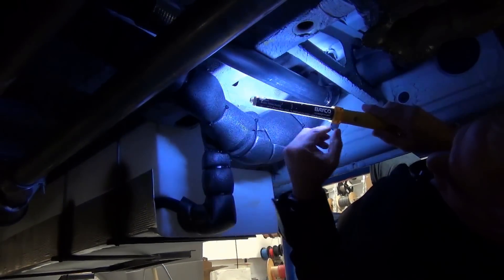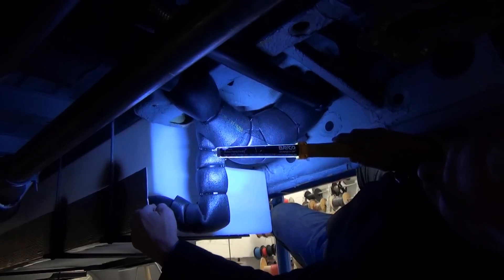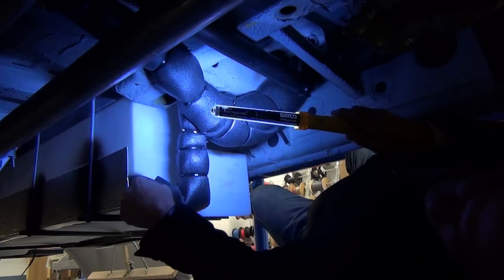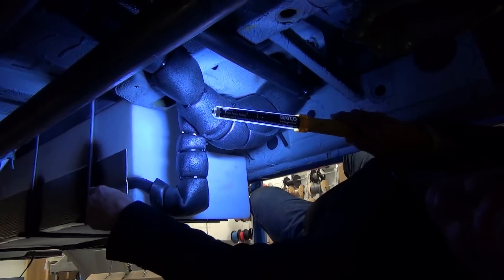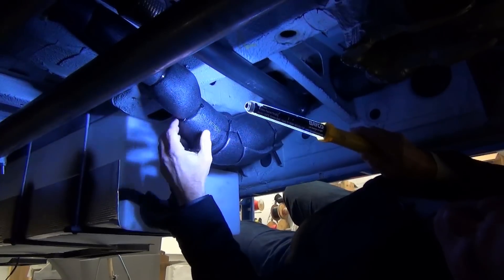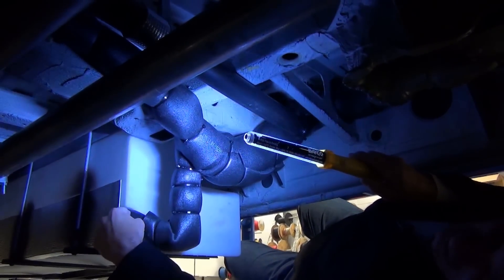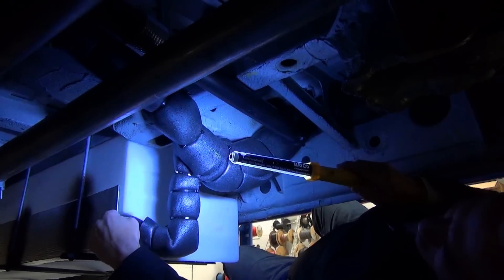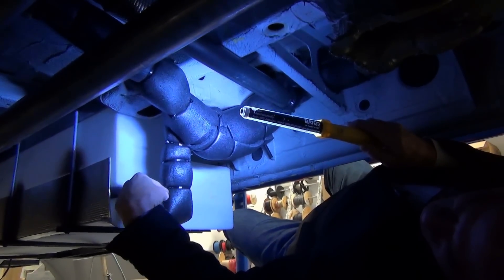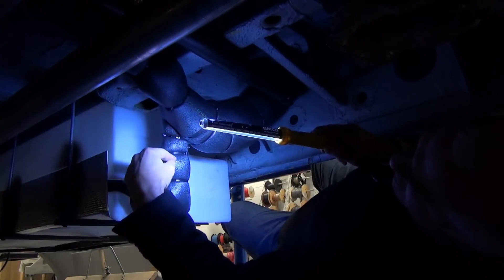You can't see the plumbing here because this is the glycol line, and you can see there's a groove in our fresh tank — we bring the glycol line along that groove. At this point the glycol is actually going back to the furnace to get reheated. It's given up all its heat to the hot water above and to the coach heat, and now it's circulating back to the furnace, but it still has some heat. So we run it along this groove in the fresh tank so that it heats the fresh tank.